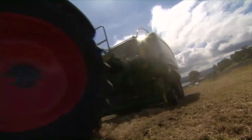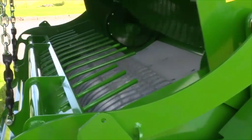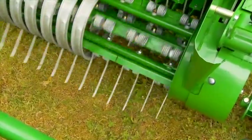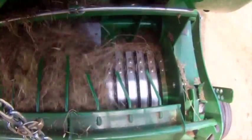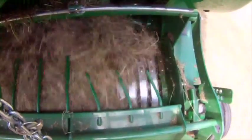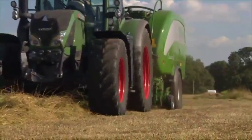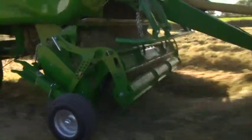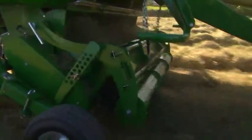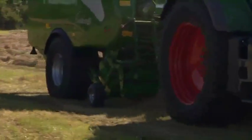After extensive testing, it was decided that all machines in the Fusion 3 range would be fitted with a 2-metre galvanised high-intake pickup. The Fusion 3 range is fitted with a 5-tine bar pickup system, which is estimated to give 25% better ground cleaning and 25% more crop transfer when compared with 4-bar systems. A new optional small-diameter high-throughput crop roller is also available, which helps to level out uneven swaths and has the ability to increase baler throughput.